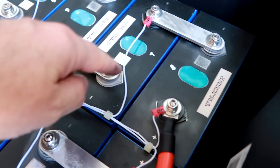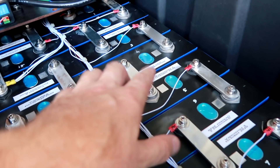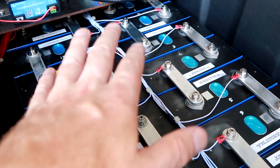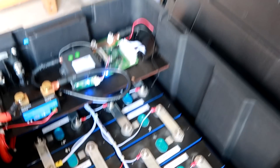So far in today's video we have replaced all the bus bars now. We still have problems with cells 6, 7 and 8 of course. I will now fully charge the battery from solar and see if we can balance the whole pack a little bit better. Many people have left comments about how to charge the battery correctly - so I probably shouldn't charge it to only 3.35 volts but go a little bit higher. I still haven't figured out how everything works correctly, but I will of course let you know everything I've found out here on the channel. This is what it's for - sharing the experience so other people can learn.